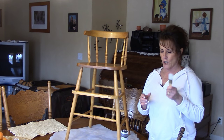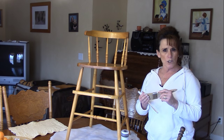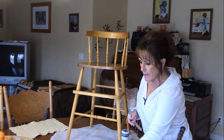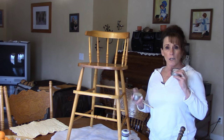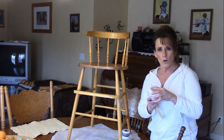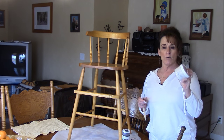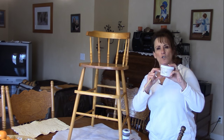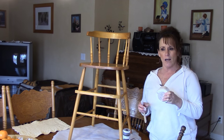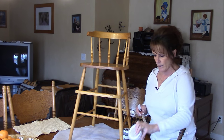You're going to need an acrylic brush. I did buy one of Amy Howard's brushes for larger projects and larger areas — I might use it later. I've got a clear wax and a dark wax, and that's going to be the antiquing part at the end. Over the top of the brown I've got Amy Howard's linen. When you get this paint, you have to vigorously shake it because the chalk — what makes it chalky — settles to the bottom and separates. Shake it for like two minutes straight and stir it up well.